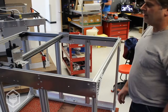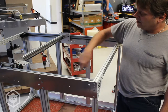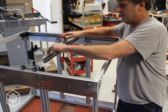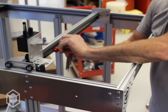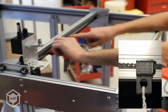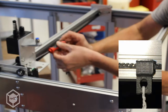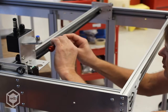With the tension of the bridge belt, we're using a clip here on a full set of Allen wrenches. We're going to take an Allen wrench and tighten the screw between the two blocks until the clip is in line with the slot of the bridge rail. That is how you know that you've reached the proper torque amount.